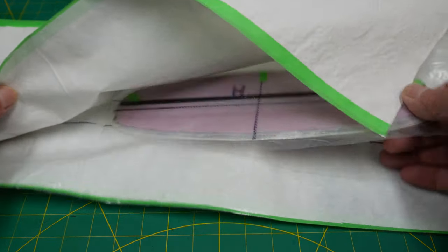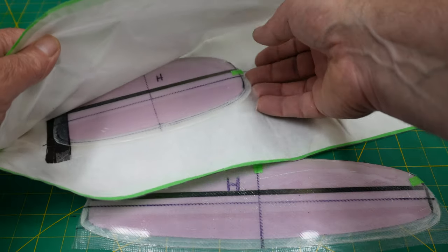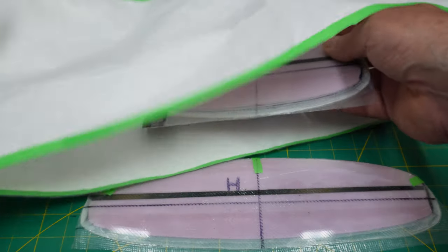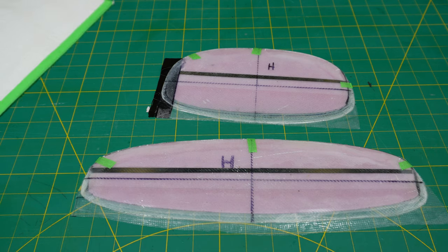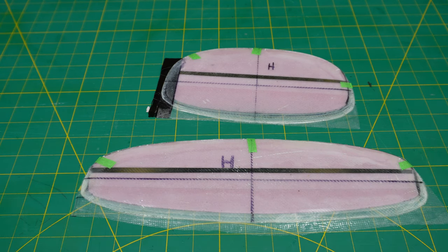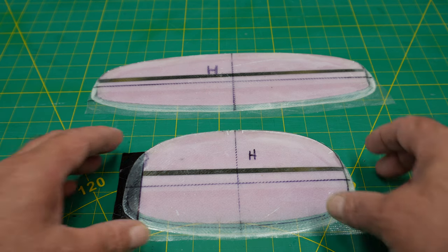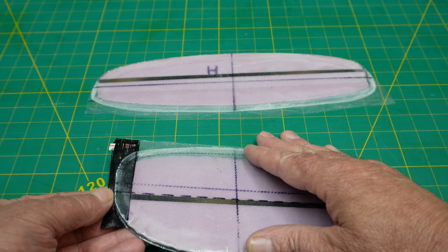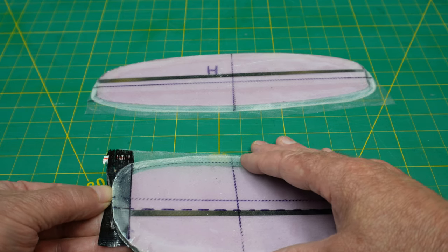Here we are releasing it out of the breather bag — as you can see it just pulls off easy, no hassle with paper towels. You can tell by looking at all the excess epoxy that ran out of the tail end of these things. I took off the tape and now it's time to pull back the mylar — which is always a cool moment. Let's see what we got — get a finger underneath one edge and gently pull up.